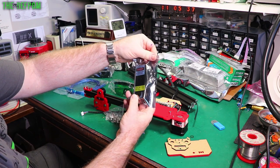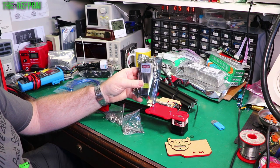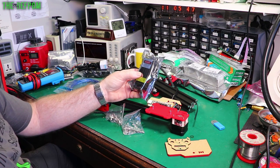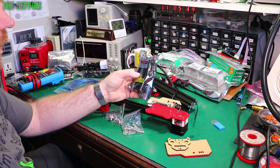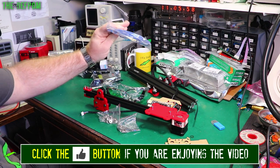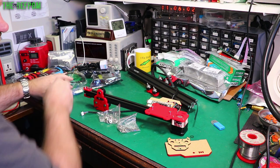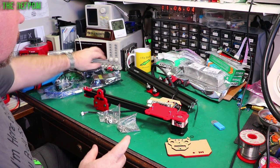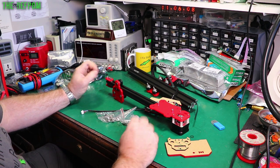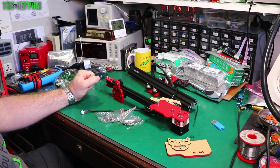Here is the actual laser assembly. There's supposed to be a 20-watt version, but I believe that rating is actually 20 watts of input power, not output power — I think they're actually more like five or five-and-a-half watts in reality. It uses 20 watts of input power. There's also a USB cable, which is a standard mini USB type. We'll put the bits we don't need right away to one side and put it together — without instructions, because I'm a real man.